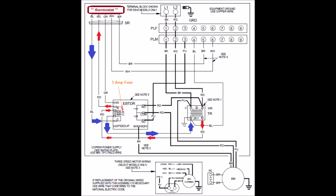And another thing here, look at that, we have a junction on that return side of our 24 volts. So I don't know where that other blue wire is, but junctions at a power source, they're either both leaving the same way or they're both coming back the same way. I know that this is returning back. So whatever this blue goes to is coming back to return and complete that circuit.